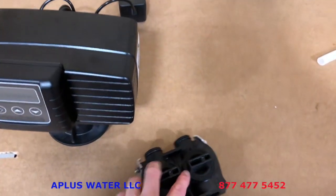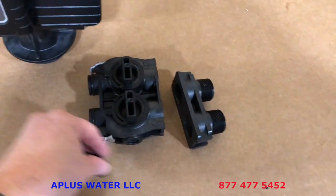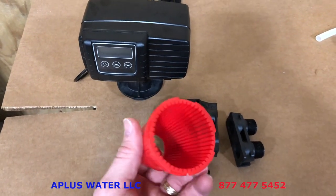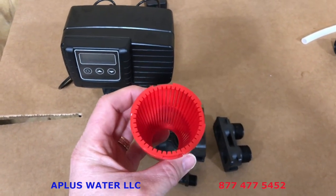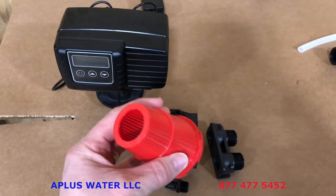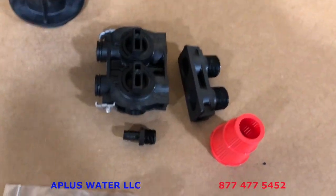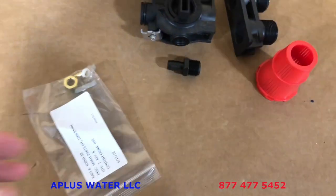It will also have a bypass and a yoke — a male threaded yoke for you to connect your plumbing to. It will have a drain barb for the control valve. It's gonna come with this upper basket here — it may be different colors: white, gray, tan, and red. You can use it if you'd like; you don't have to. As long as you hook up your softener correctly with water in and water out, you would never need this upper basket. There is also a baggie of small parts. Those small parts we'll get into as we connect our brine line to the control valve.